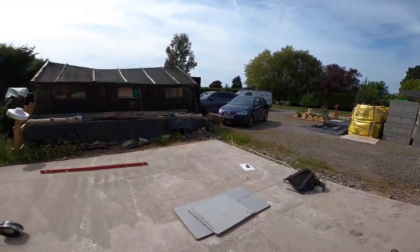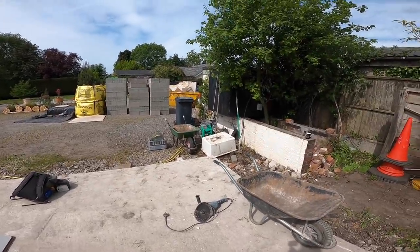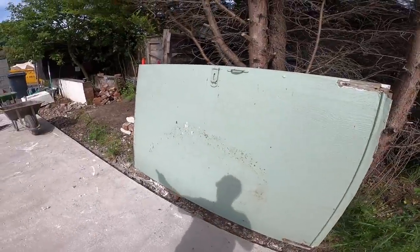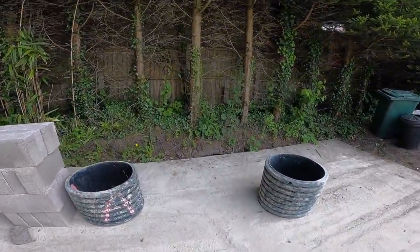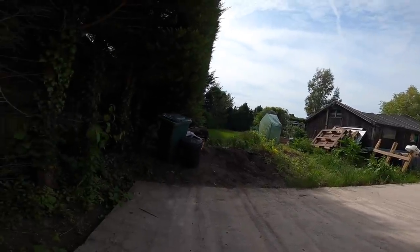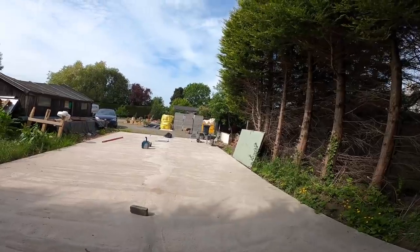We were going to set the corners up and run the bottom coursing, but it's getting on a bit now to be putting the mix in, so we'll probably just use our new magic tool, the Fitz Brick. You can just set one block and pull a line on it, and we're not running it in one go. Because we've got an expansion in the centre, we're going to run it in sections. So we're going to run that section, and that section, and that section. So it's all roughly the same. This is 5.5. That's 6. So we'll do it section by section. It's just more manageable when you haven't got loads of boards going off in the sunshine. So that's it for now. Maybe a bit of time lapse while we do a bit of loading out.